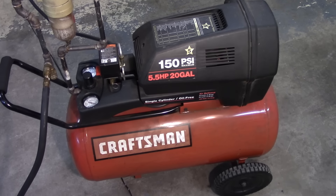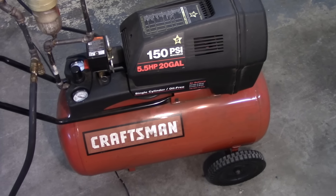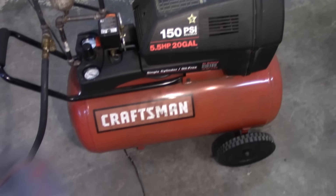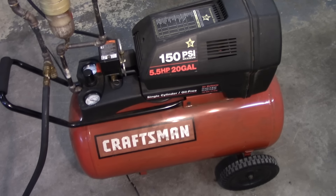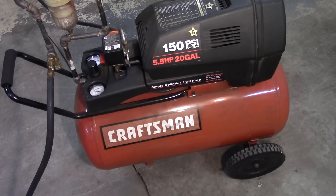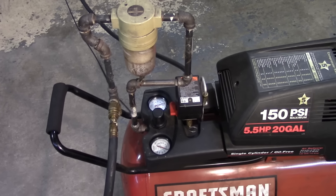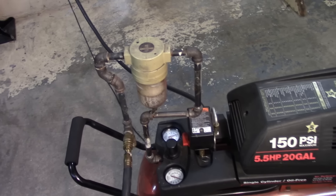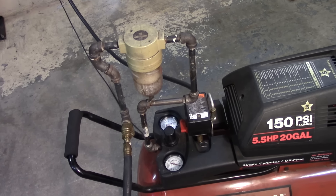Hello everybody. Here's an image of my old Craftsman 20-gallon air compressor that I use for painting and airing up tires. The other day I tried to put my Ingersoll Rand impact gun to take off a wheel of my truck and I couldn't get the wheel off. I thought I had a problem with the impact gun until I looked more closely at my air compressor. On the top of the air compressor I have quarter-inch piping and fittings and standard quick disconnects, and I think that's causing a reduction — the flow of air is not good enough for the impact gun.